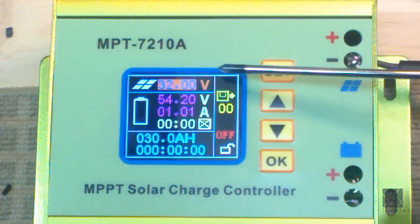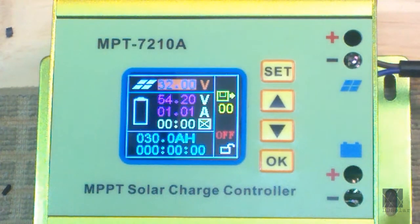I've pressed Set and gone to the 32 volts setting for the solar panel. I'm setting it to 32 volts — I really don't want my panels pulled down below 32 volts. It's two 12-volt panels in series. I run other things off those panels and don't want to pull the voltage too low. Solar panels on a DC converter can actually latch — that's where you pull the voltage down too low and it collapses. If you unload the charge controller, the voltage will stay collapsed and latch. You want to avoid that point where the PV voltage will collapse.